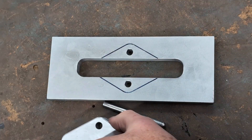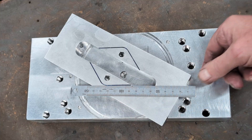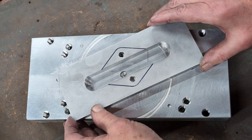By moving the y-axis by a calculated offset, two edges can be machined in the same setup. The opposite edges are then machined by pivoting the plate to a new bottom pin position. This position is the same offset from the datum hole but located on the opposite side.